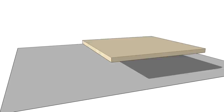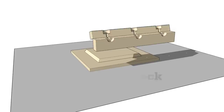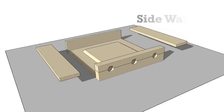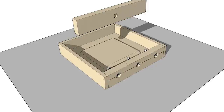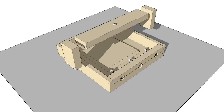Here's the form for casting the legs. The form has a three-quarter-inch plywood base with an angled inset attached, just like the garden boxes. A two-part block holds the seat bolts in place and can be taken apart after casting. The end wall and side walls are made of plywood. The anchors are three-eighths galvanized carriage bolts, three and a half inches long. The form has a bridge that holds the stretcher bolt in place. This stretcher helps to prevent side-to-side racking, as the seat boards have only a single attachment point on each end. The bolt block and bridge are made from standard framing lumber.